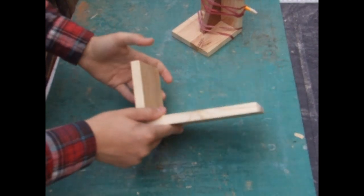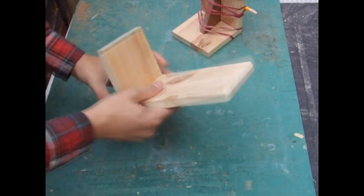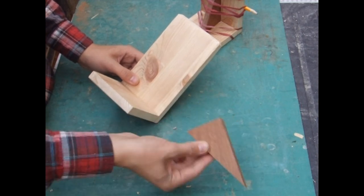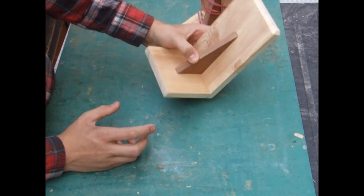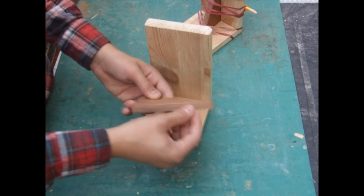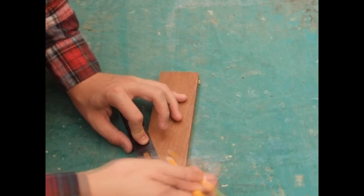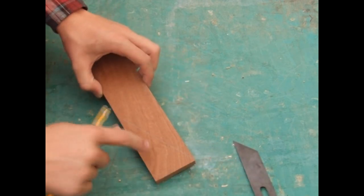At this point you could call it quits, finish them up with some finishing oil, and they'll look quite plain and simple and do the trick. But I thought I'd add a little touch of dark hardwood — this is ziricote — and just stick this in here to add an extra little detail. You could also, if you had a fret saw, do some fretwork to make it look a bit more fancy. I'm just using a marking gauge to mark a line at about 30 degrees, though you can decide the angle at this point.